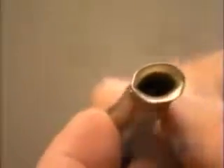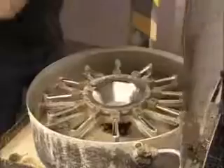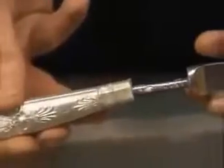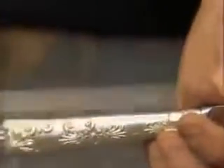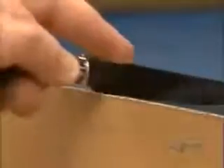After polishing, the solder line won't show. Workers pour cement into the middle of a centrifuge machine and load the hollow handles all around. As the machine spins, it fills each handle with cement. Now each handle gets a stainless steel blade — the blade's stem goes directly into the wet cement. A clamp holds the parts together, then they submerge the knives in hot water for 12 minutes. This cures the cement, making the handle-blade connection rock-solid and giving the handle weight.